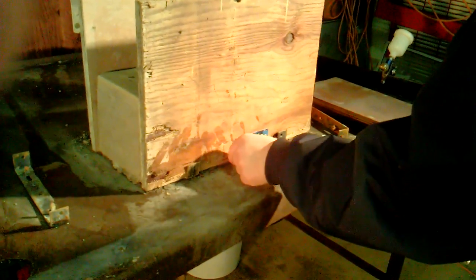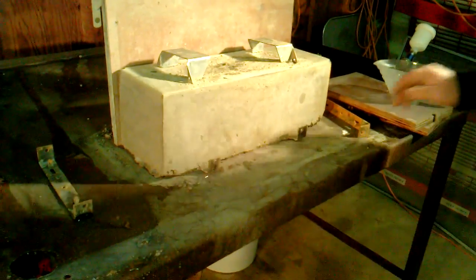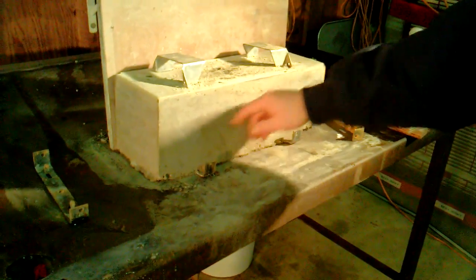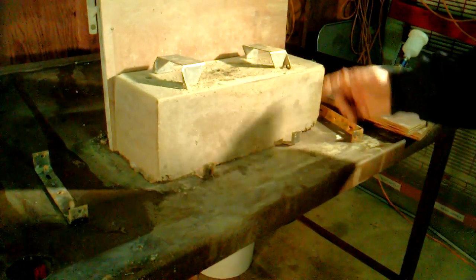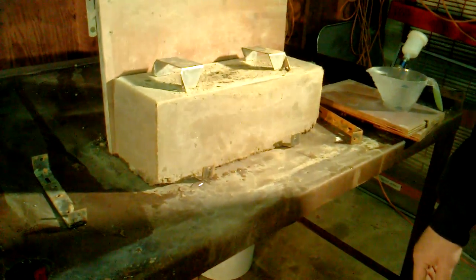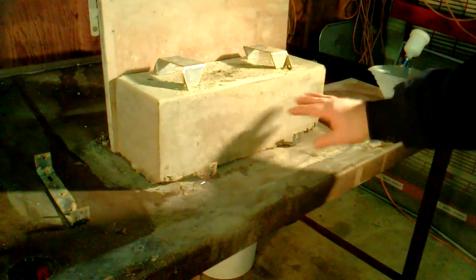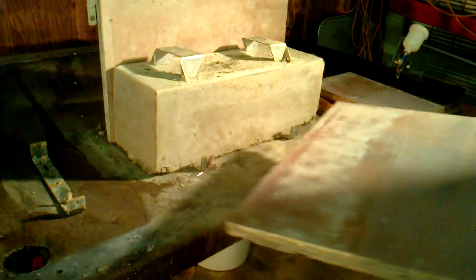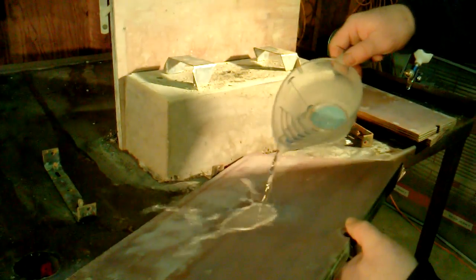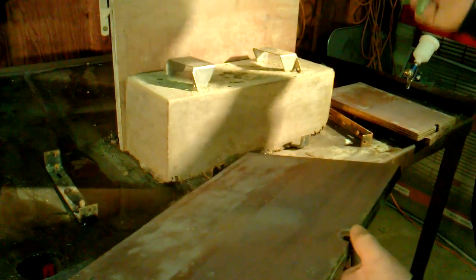Same with the front form. What I did notice is that the concrete actually came out pretty smooth for inside of a three-quarter inch form. I didn't sting it or anything — I just tapped on it to see what it did with rock pockets and pushing air. As a wall, it looks really good. Even the front form is really hydrophobic too — water just beads off still. Definitely, definitely reusable.